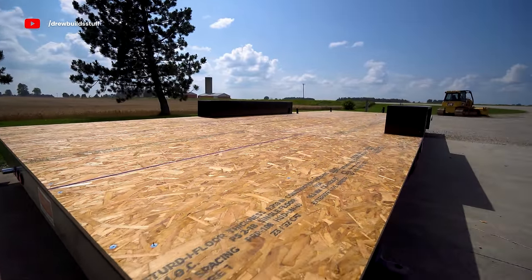Now on each of these overhangs, I'm just adding a couple pieces of blocking that extends into the frame of the roof, just a stud or two. And this will just give it a little more support on that overhang. Then I also added these couple boards as a rough opening for a skylight that's going to be right here. And I also had to frame in these tiny little walls where the slope and the roof changed. And that's the entire framing for this tiny house, now complete. A little more sheeting and we're pretty much closed in.